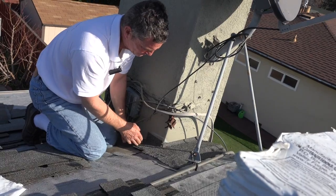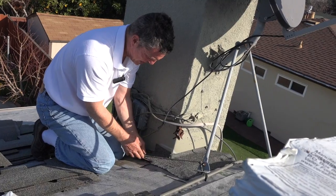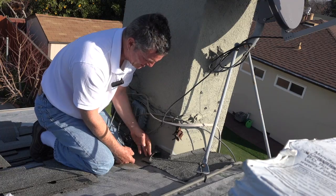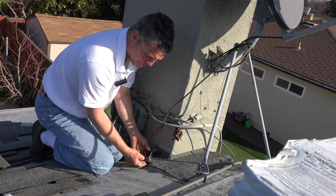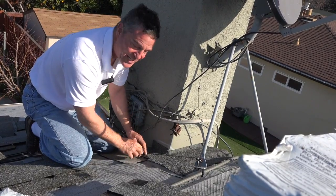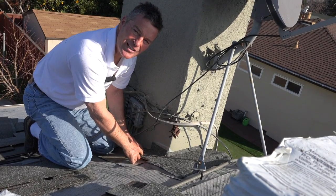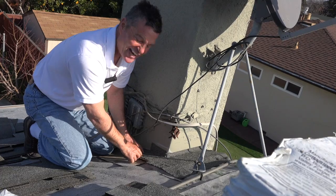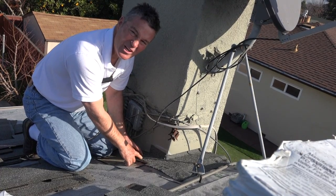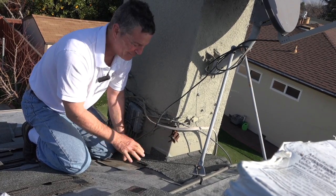I got a little crooked here — this should always be to this edge and straight. Some people like to leave this open, then when the shingles come up here they nail it, push it down and rub it, and they don't have to put any caulking on the nail. The city requires that your exposed nails be caulked, and I don't usually like black spots — though we do sell a touch-up kit. If you get a black spot, you throw these little granules in and it covers it. That is separating yourself from other roofers — that is quality.